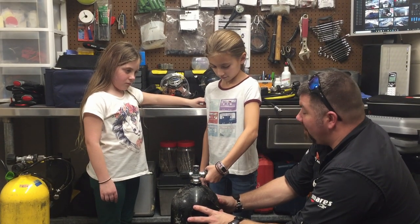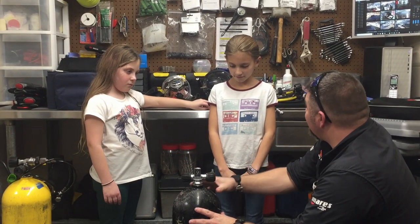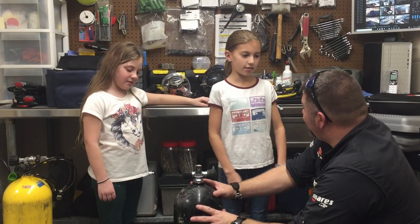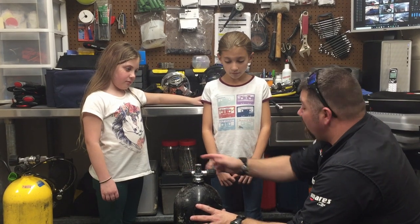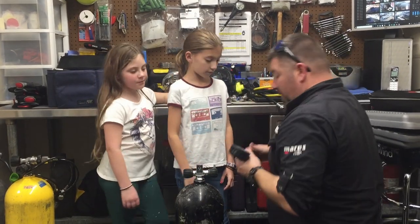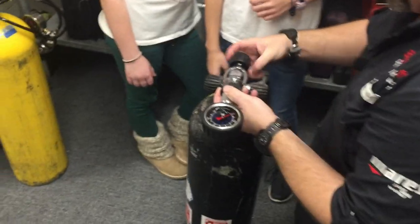Just turn it. There, see, there's a lot more pressure behind it, right? We can do it a couple of times. Sounds like there's a lot of pressure behind it, right? Do it a little bit faster. Now you can barely hear it hissing. Right, so for all intents and purposes, we would say that tank was empty, right? But then when you go to do the switch, you can hear that there's still plenty of pressure left. So now what we're going to do is we're going to put the pressure gauge on it. We're going to look to see that it's empty.